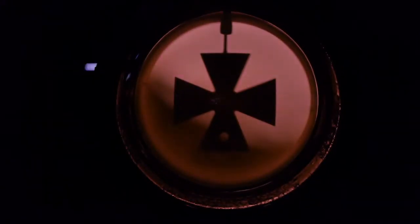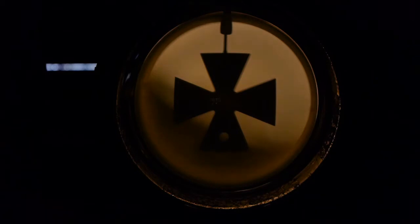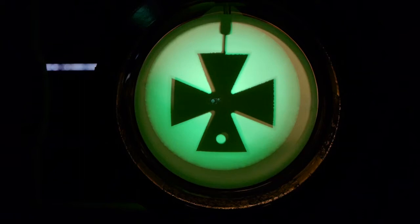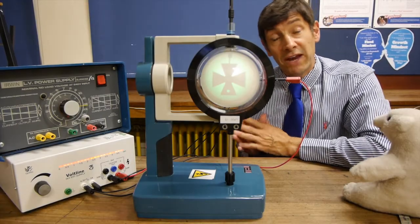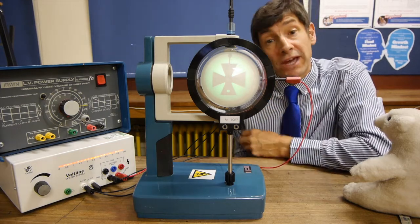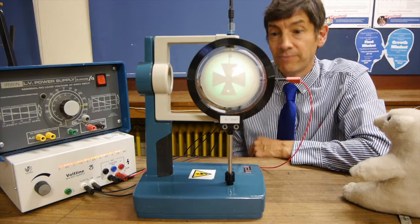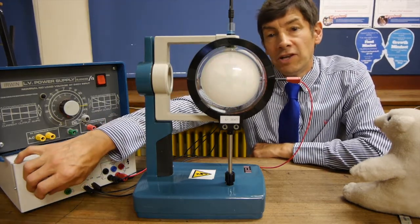I'm in the dark room now. Let's turn on the power supply — the filament will come on pretty quickly as it was fairly warm already. There's the image on the screen due to light forming a shadow of the Maltese cross. You'll notice a little hole in the bottom part of the cross — that's important for later on. We'll now turn up the accelerating voltage. Electrons produce a shadow image in exactly the same way, caused by the metal Maltese cross not being transparent to the electron beam — just like light forms a shadow.